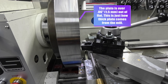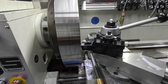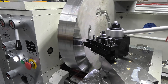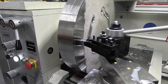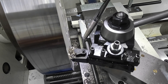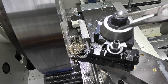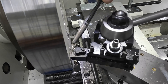Now we're on to the front face and the first order of business is to do a minimum clean-up — get all of the grime off the front and get it uniformly flat. This is my favourite CNMG 432 insert, put at a weird angle in order to get the reach on this part, and as you can see it's having no trouble whatsoever cutting the 316 stainless steel. But I really needed to get it on a more solid setup than this — I did come up with a better arrangement, so I hope you'll come back and see that.